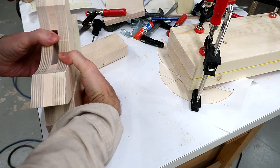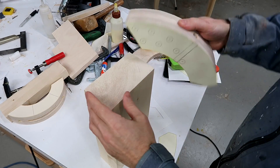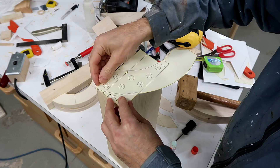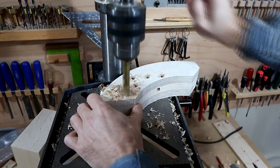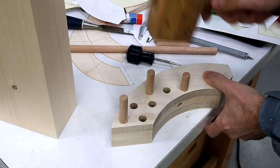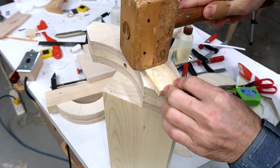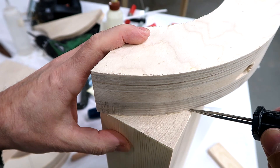This whole arrangement needs to be supported from the back by a beam that attaches here, but much bigger — like this. To accurately position this part, I'm just going to use a complementing template to position the dowel holes in both parts, and then the dowels will line things up. I'm just going to put in a few dowels for this dry fit, but even so it'll be pretty hard to get apart again. Before I pulled the template off I scored some lines through it, and I can see I'm pretty close.